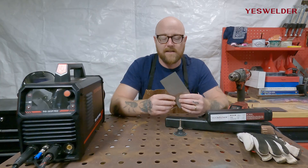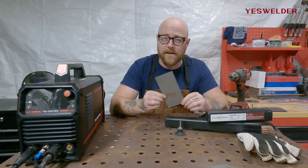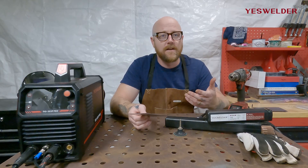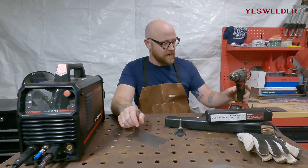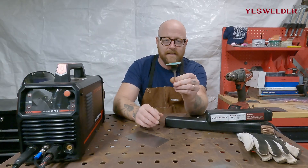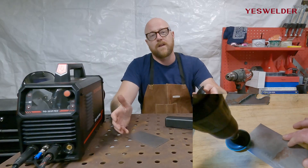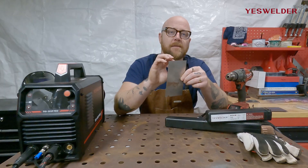When carbon steel sits out it can rust and oxidize — that kind of stuff. This has to come off before we weld it, as does the mill scale. We can use an angle grinder with thick mill scale, using a lower grit like 36 or 50 to get through it. On thinner sheet like this, one of my favorite tricks is to use a regular electric drill with a small sanding disc attachment in the chuck. It's very easy to just get the mill scale off the edge. You only need to remove it where you're actually going to be welding.